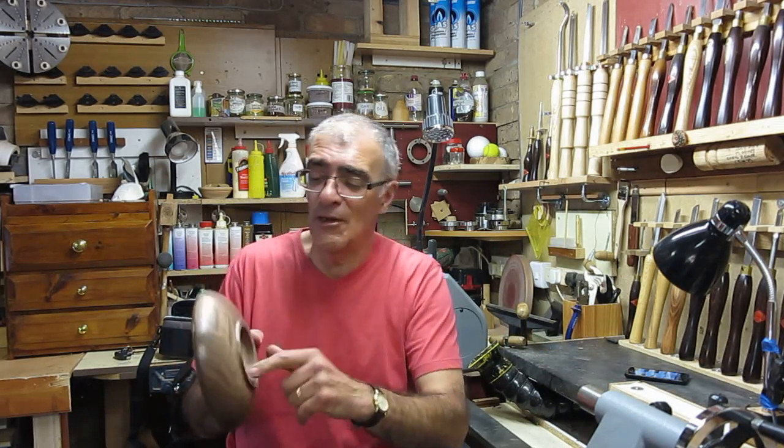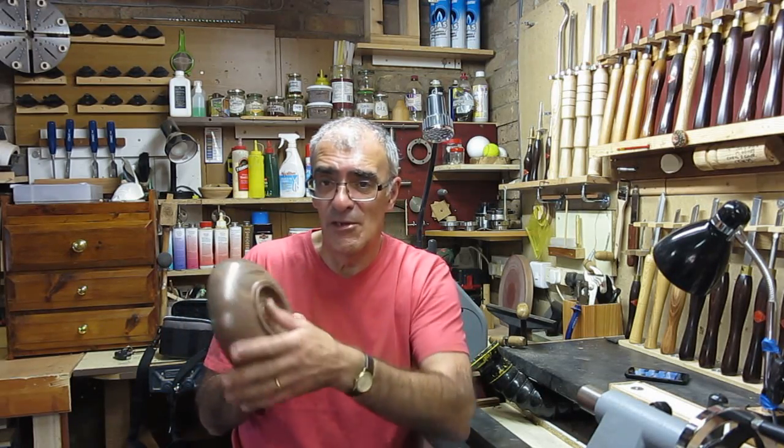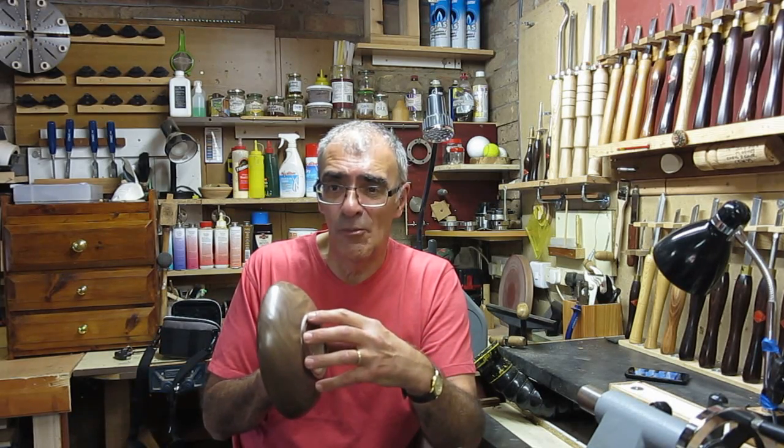Great. A great response. All I can say to that is that if Brad has used that method for 10 years, then maybe I was being overcautious, and a glue block, providing, in my opinion again, that the wood is dry and the glue block is dry. No wet wood, because the glue will not hold as strong as it would or would need to. So basically what you would do would be, let's just say, a much shallower mortise there, yeah, on your blank. This is the unturned blank, and then a small tenon on the glue block, and then you would glue that into your blank.